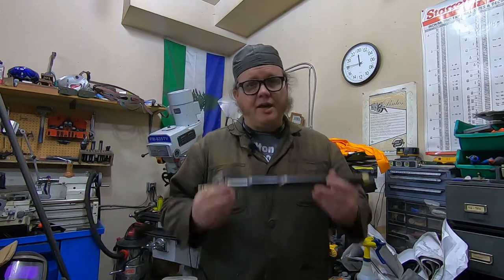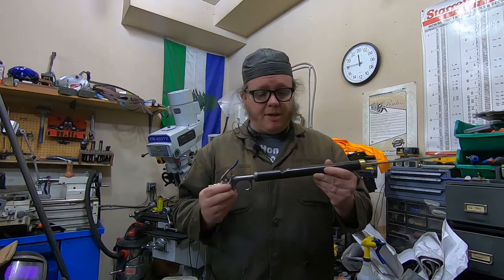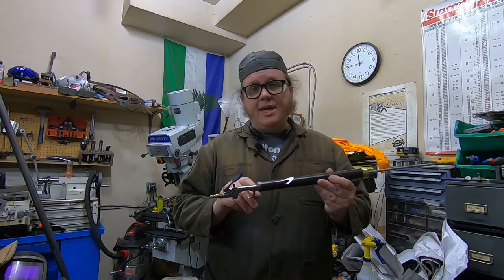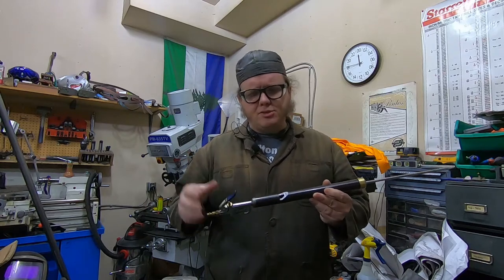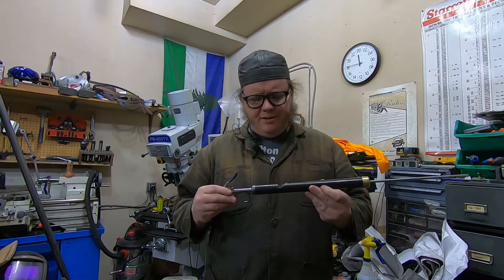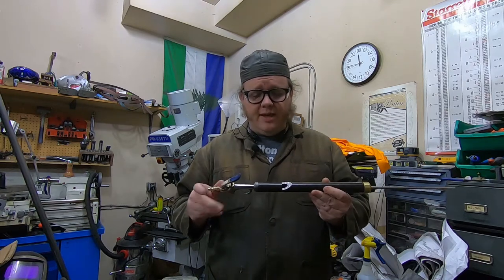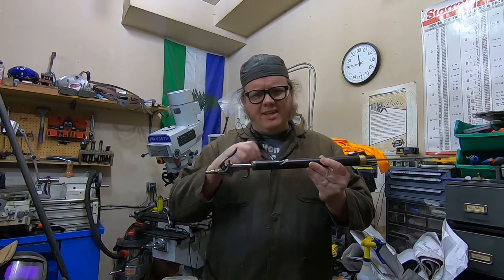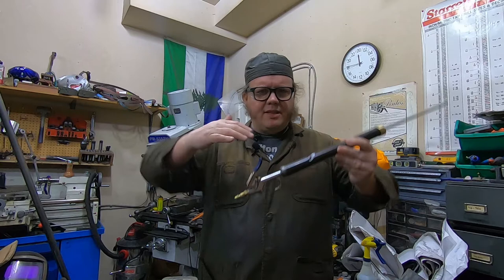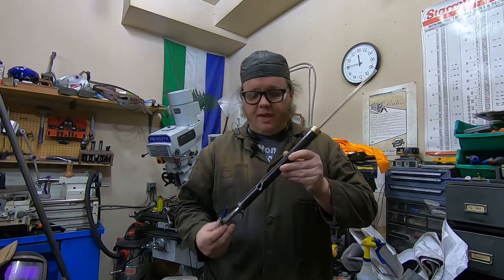When we left off, I had just finished making the connection for the air adapter on the whistle pipe itself, and that works nicely, except that the tone of the whistle was suddenly much more weedy, much more whistly, but like a bad kind of whistle. And my best guess is still that it's because I'd moved the point of injection of air so much closer, it didn't have time to expand evenly and cleanly. And it was causing lots of turbulence as it came out of the aperture.